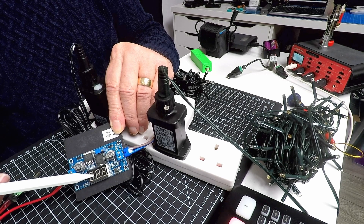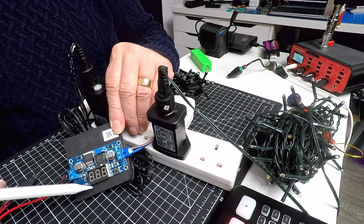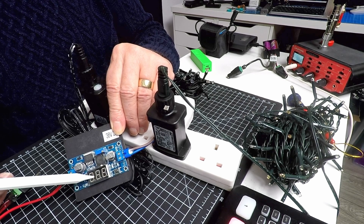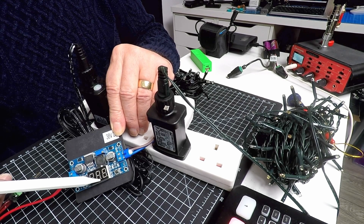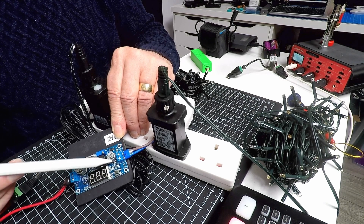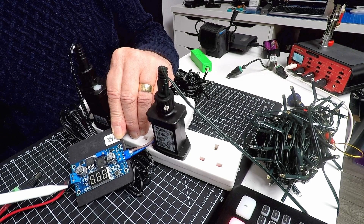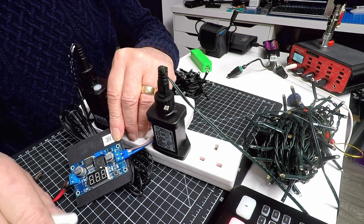If you're using this on a lithium-ion battery, that's useful because you can see when it needs to be changed — when it's dropping towards 6.6 volts. USB will stay at 5 volts until it cuts out because of its internal limiting. So this is just a step-up converter going from normally 5 volts up to 38 volts.